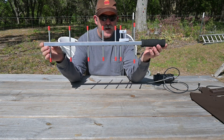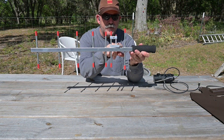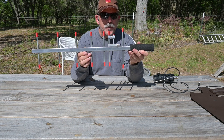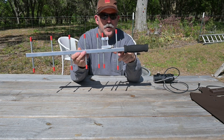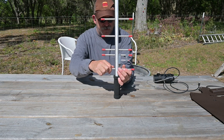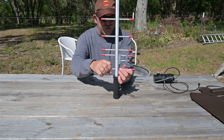It is light, weighing 11 ounces. It features a BNC female RF connector with a gamma match fed driven element. The elements are hollow and element retention to the boom is accomplished with threaded inserts into the element tubes that pass through perforations in the square tubing.